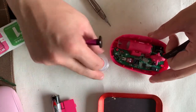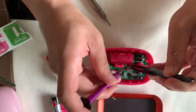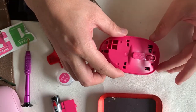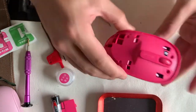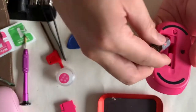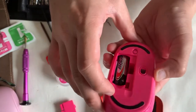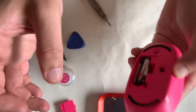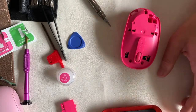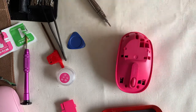Remember, the screws for the board are Phillips-style — the cross-style — a couple of them. Putting on the top shell, make sure everything is flush between the two pieces of plastic. Check that scrolling is okay. Add the topmost top piece before trying the left and right buttons. Put in one battery — red light flashing means it should be good. Then fasten all the top screws and do the testing.